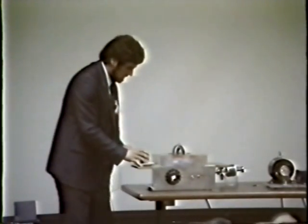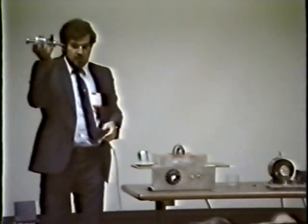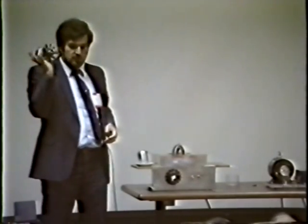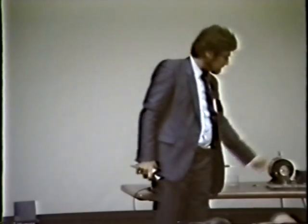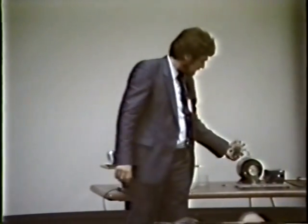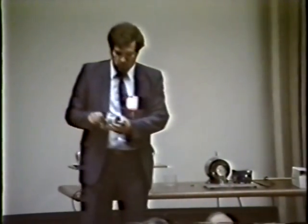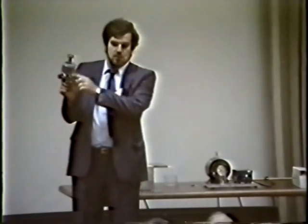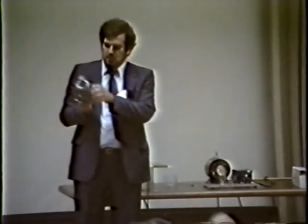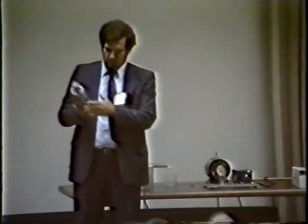I have another little demonstration. This is very heavy — this is the rotor of a standard quarter-horsepower induction motor. What we've done is pull out the rotor of a typical induction motor. Notice what the rotor is: it's just a bunch of iron with short-circuit returns. For other reasons these short returns are slanted, and that's why it's called the squirrel cage.